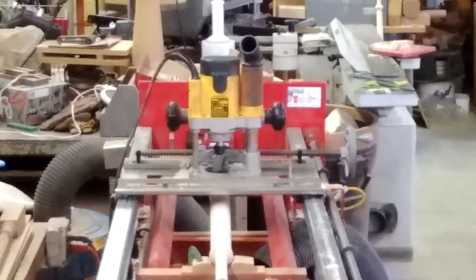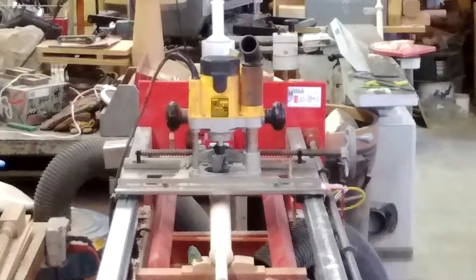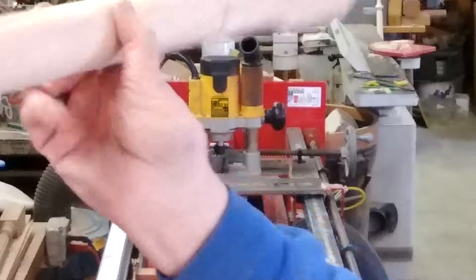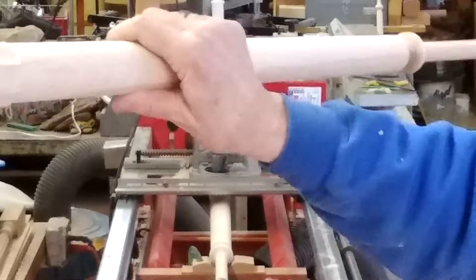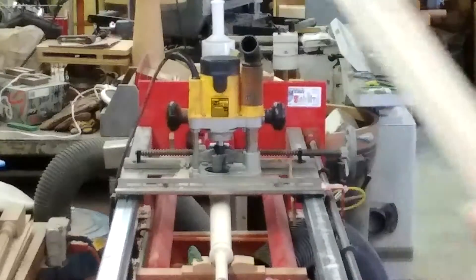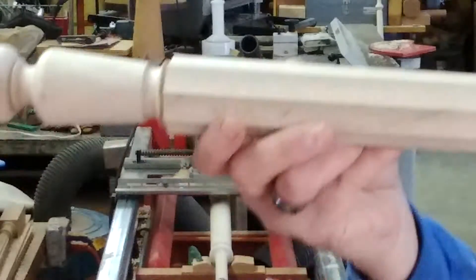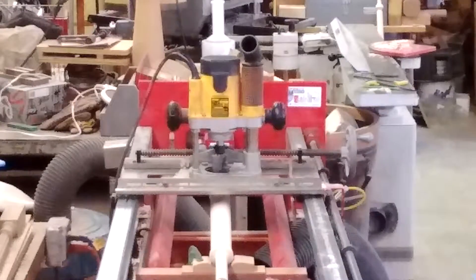So here we are. I've got one of the plain balusters — looks like this, with no fluting on it at all. And we're wanting to get it to look something like this. You can see the fluting here. It's a very mild, concave flute based on about an inch and a half radius.